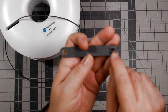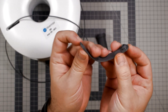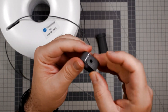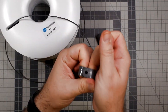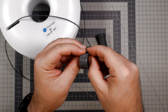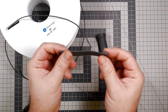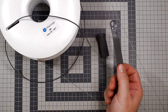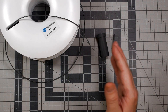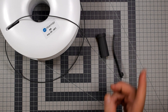Then, for example, we can take a look at this strap I just designed today and printed with polypropylene. On one side we have a small ledge, on the other side we have a small hole. We flip this thing 180 degrees, push one into the other, and it gives a really nice and solid lock that does not want to separate easily. However, when you want to, you just squeeze it tightly and remove the pin from the hole. This opens a lot of possibilities for parts inside of drones, maybe not the drone frames themselves, but really a lot of possibilities.